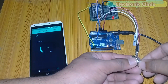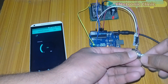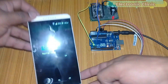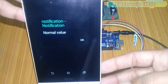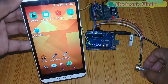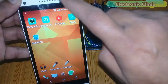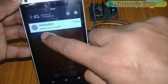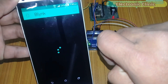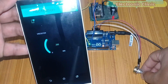This problem of monitoring the sensor in real time can be solved by using the NodeMCU module. With NodeMCU you can monitor sensors in real time, and it can also be programmed to send notification or alert messages whenever a predefined value is exceeded, so you don't need to monitor the values all the time. One major advantage of the notification widget in the Blynk application is that even if the app is running in the background, you are still informed through a notification message, which works just like the GSM module.